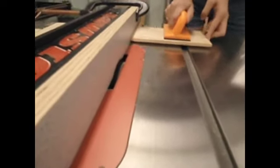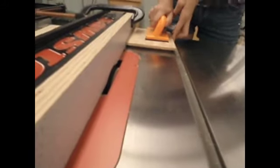Now let's watch a short clip on how to complete this step. The operator has the push pad located on the metal tabletop and not over the cutter head. As she cuts across the straws, she transitions to cutting in the direction of the straws, or in the direction of the grain. Her left hand is assisting in keeping the board against the fence the entire time. Now go get your instructor and let's go complete this step.